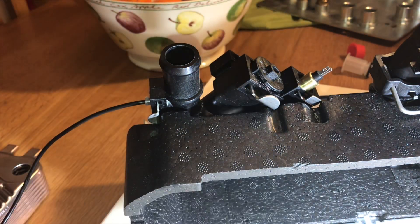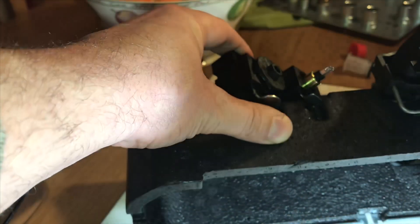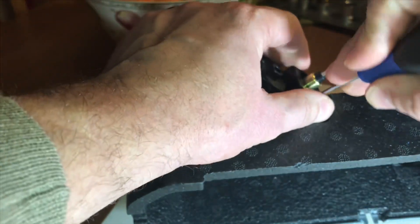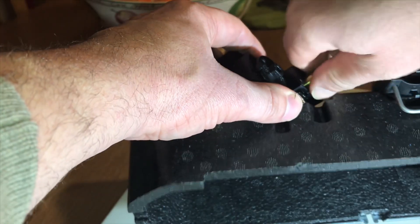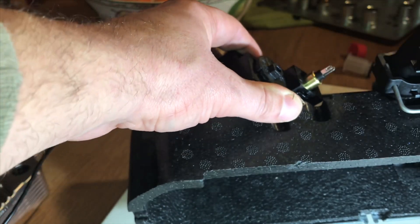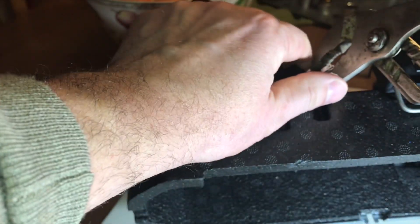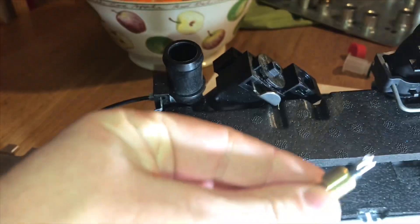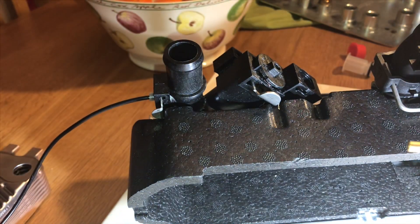Just here we have an NTC. Drain the system down — should an NTC fail, just take it out, clean it, and check the resistance. We'll do the multimeter bit later on. Should you wish to do a resistance check, remove the harness and go straight onto the thermistor. Sometimes cleaning them out fixes them. This one's brass — they have superseded them to stainless steel now, which is a lot better.